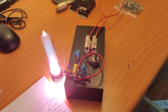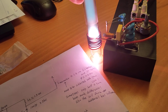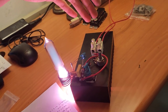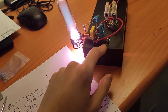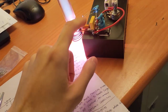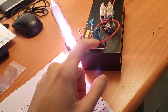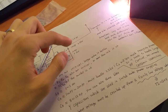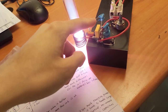So that is all about today's video, and if you want to build this circuit, I will recommend some parameters for you. First, the input voltage can be 12 to 20 volts if you are a beginner. And you should use the IRFP460 MOSFET, which is very handy and has good performance in such a high frequency oscillating circuit. Also, this filter capacitor can be eliminated, and you should first use around 8 nanofarad gate divider capacitors here. Around 8 nanofarad will make it easier for the circuit to oscillate at a lower voltage. Also, for the main resonant capacitor here, you should use around 100 picofarad.